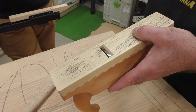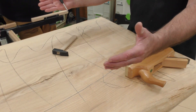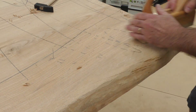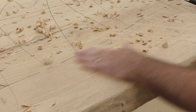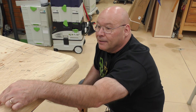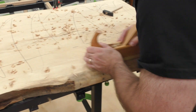We're going to go back to leveling and then smoothing. As we go you'll see — there are a lot of dips. What the scrub plane creates is a shallower version of those dips. I go across the grain like this and basically when I do that I get little diamonds. So when I take a larger plane and go across it, I'm just taking down the highs and lows.